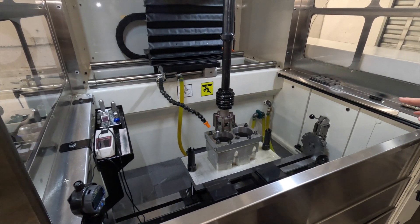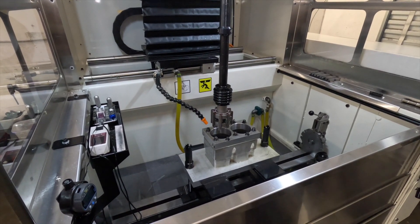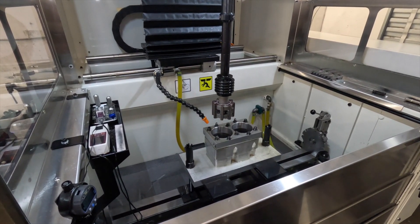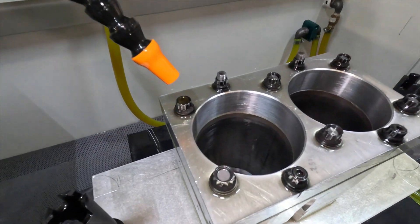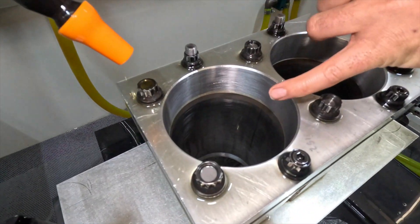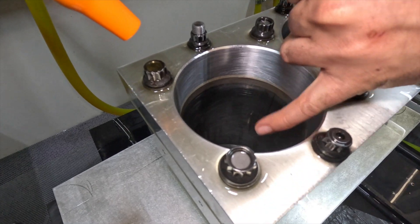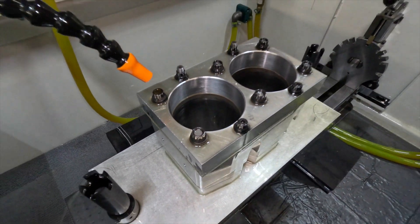I'm going to do a two-and-a-half-tenths touch-up pass just now, just to show you how out-of-round and worn these cylinders are. If you put the camera in there you'll see how they look. You can see the lines on here — the pistons had vertical gas ports in them, and the vertical gas ports are in the wrong place.